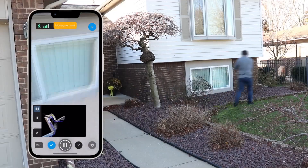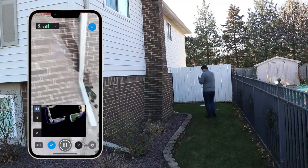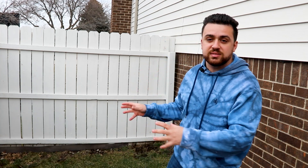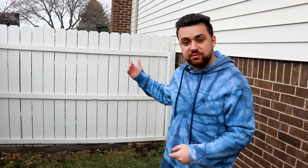In a previous video I used the iPhone's LiDAR sensor to do a topographic survey of my entire house. In one of the scans I started on one side of the fence and scanned all the way around to the other side. Once I made it to that side, it almost looked like there were two different fences — because the iPhone had drifted after holding it in my hand and trying to compensate for all the error. Today's goal is to start scanning here, and by the time we get to the other side of the fence, our scan will be better aligned with less drift. I'm hoping the gimbal will increase our level of accuracy and create less drift in the data set.